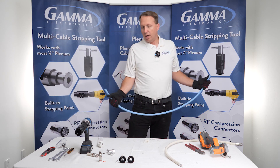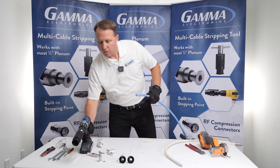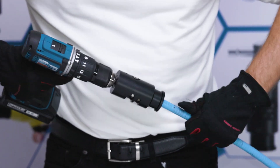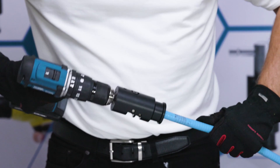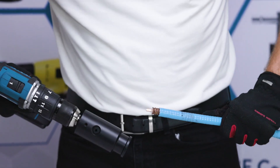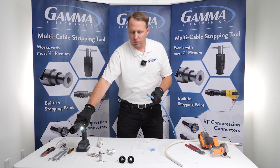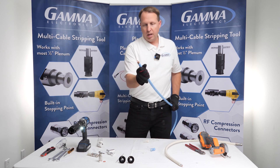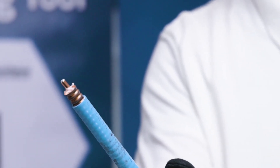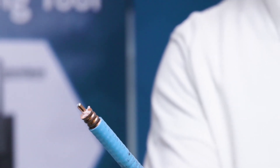I'm going to go ahead and do the RFS cable right here with the drill. As you can see, I have the same bushing. We use the same tool, same bushing, and we're able to accomplish something really cool. You can see here there are three valleys, that third valley is still visible, you've got a flare, and you've got a nice bevel tip. That is a really, really good looking strip — and you can also see how fast it was.